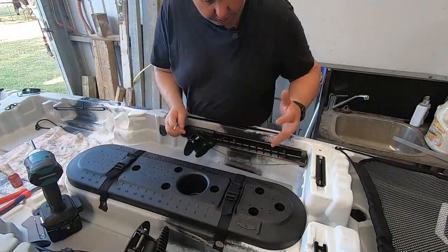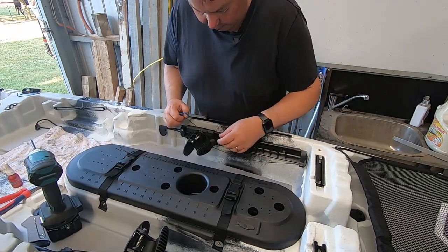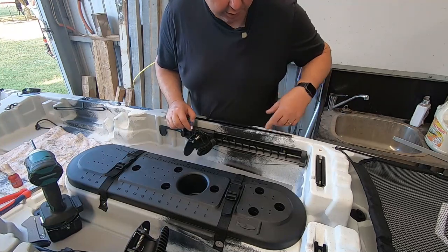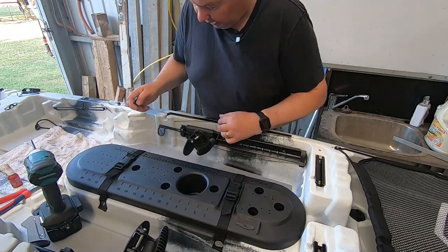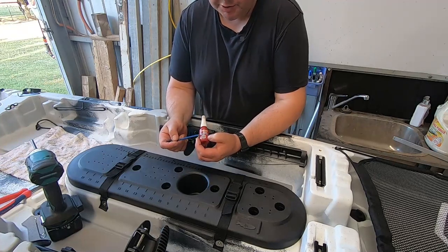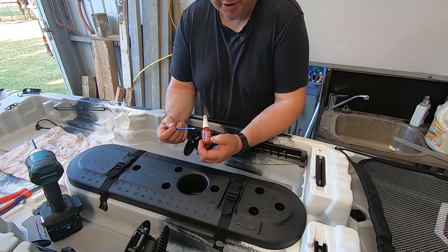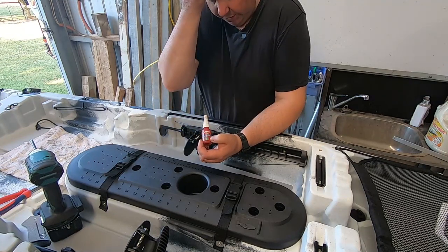So what I did with the other one was just pull out every screw basically, and they're all stainless screws, or they seem to be. Hopefully they're 316 stainless, which is marine grade, who knows. But anyway, we'll pull all this stuff apart and just Loctite everything. We're using 243 Loctite, which is the blue stuff, which means it'll lock onto bolts quite well, but you can still get them out with mechanical means, as in screwdriver, spanners, whatever.